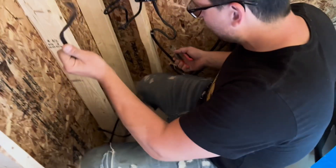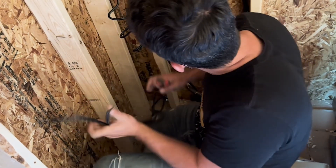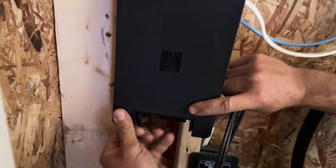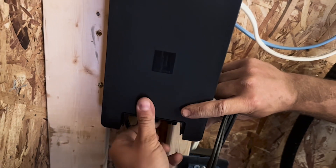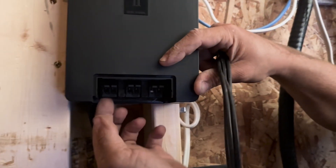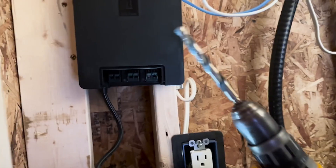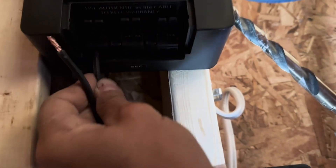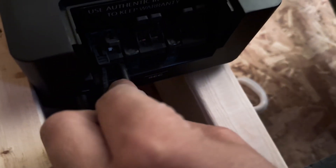Plug each zone in individually. If you look at the transformer we have capacity for three zones. We're going to flip these switches up. To strip the wire, look right under there — there's a little hole to stick this in. Stick one in, clamp it shut, and make sure you've got a good twist on them so they don't get frayed, because if the two frays touch each other it'll just trip that breaker every time.